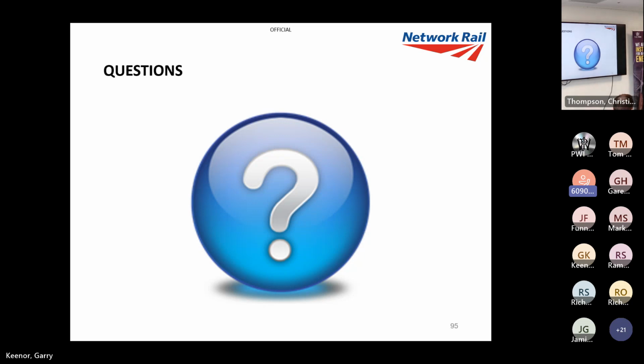If you can get a good fully ballasted site and DTS it, tamp it well, your tamping is important, at the right depths, pressures, all the other stuff about tamping. So if you're disciplined in your tamping and you use DTS, that's some of the results we're getting.